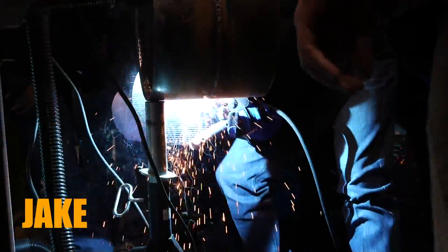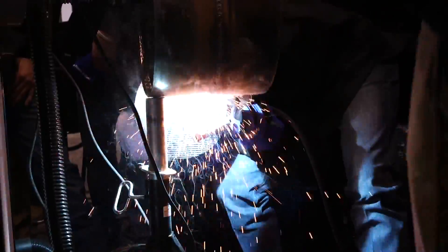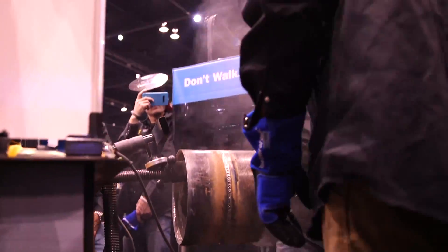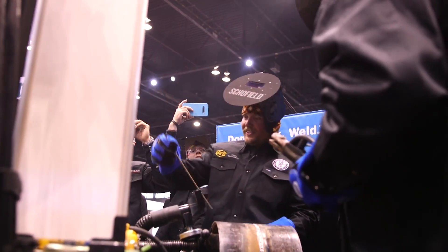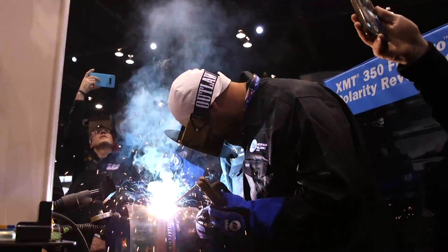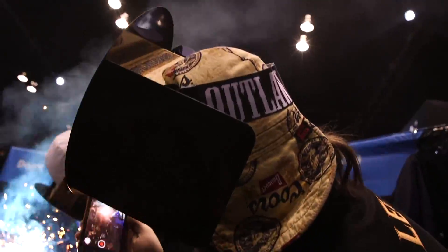Right now I'm running a fill pass on this 12-inch off that XMT 350 Field Pro. With a fill pass it's a similar technique to your hot pass. At the top I'm doing a bit of a longer whipping motion — letting the metal freeze, pushing back in, letting that metal pile up. As you get down to the side, gravity's fighting you a little bit more so you have to adapt. A little tough to fill the side perfectly. When you get to the bottom, whip out a little bit to let that metal freeze so it doesn't droop down on you. The biggest thing is you've got to adapt to the fit up you're given and go from there.